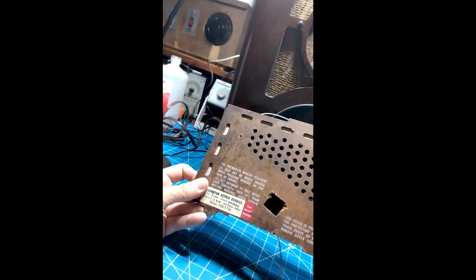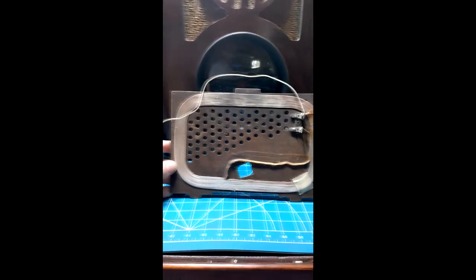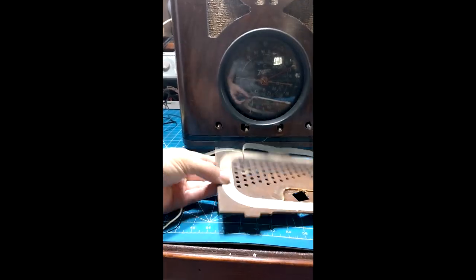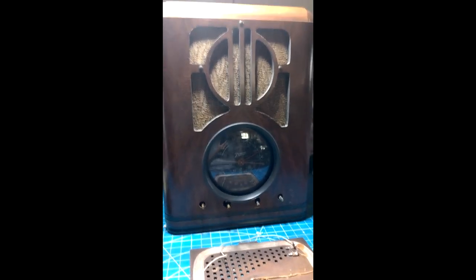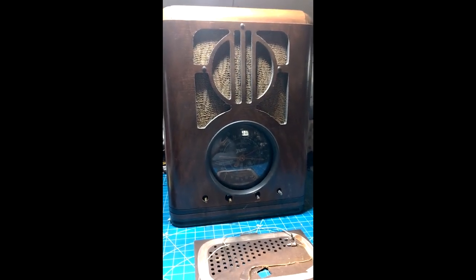This component in the back is a 1960s AM antenna from an All-American 5 radio — a small desktop 5-tube radio. It's not for this set; these antennas weren't even invented yet when this radio was made. This radio uses a wire, a long wire that you would stretch out. Back in the day, people would run them from tree to tree in the backyard or around the baseboard inside the house. If the radio is performing well, you should be able to get any local station that's really close to you.